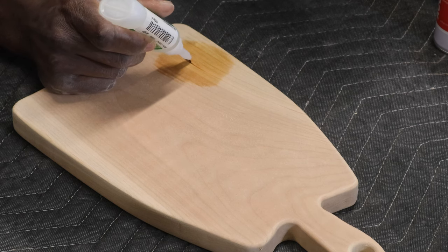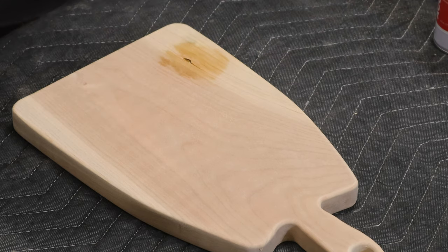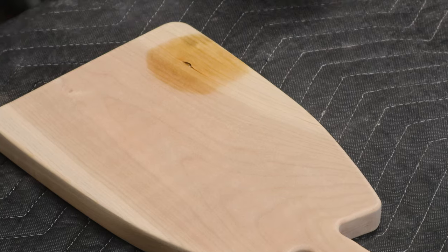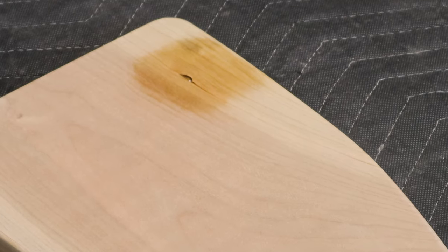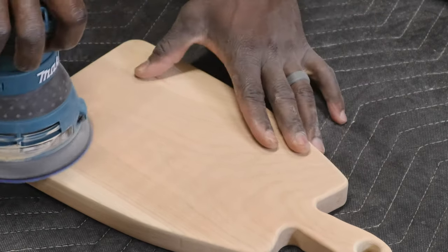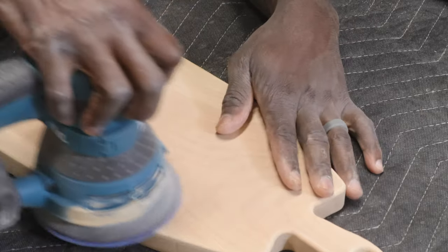Here's my reverse CA technique where I hit it with a little bit of activator first, then I add the CA glue, then I hit it with a little bit more activator. You'd be surprised — sometimes the activator allows you to use less CA glue than you originally planned to fill whatever crack or hole you're dealing with, so if you haven't tried it before it's worth a try. I made six boards out of this piece of lumber — some filled with black CA glue and some with a lighter color. I think it's just personal preference; honestly the cherry looks good with either. I'm partial to black on darker woods but I thought the cherry looked really good with both black and clear CA glue alike.